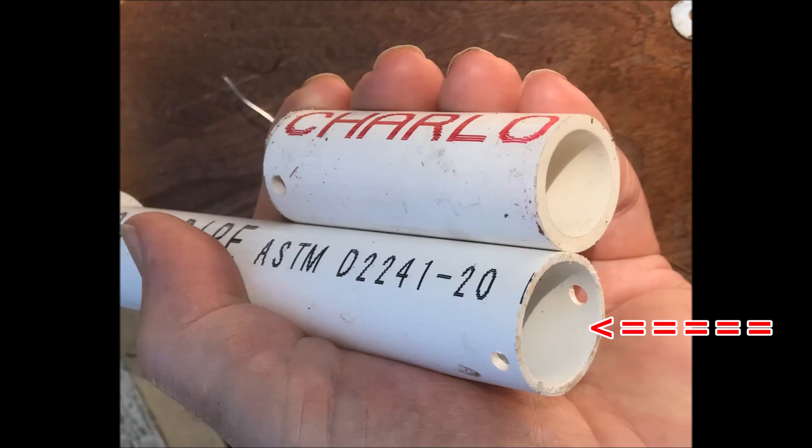Let's briefly discuss some of the materials that will be used to make these float valves. A lightweight three-quarter inch PVC pipe was used to make the body of the float valve. There are lingering questions about the food safety of PVC pipe, so eventually I want to replace these with safer plastics like polyethylene and polypropylene.